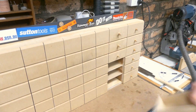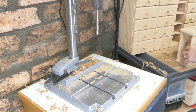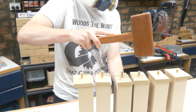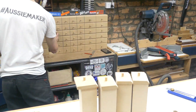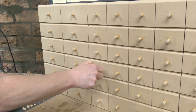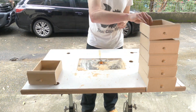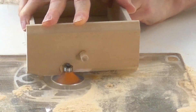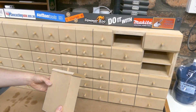We're getting very close to completion — smacking in knob after knob and checking each one. But I decided those square bottoms just looked crap, so back over to the router table for 54 more passes — putting a chamfer on the bottom as well as on the top. It looked much better and I was very happy with that design change.